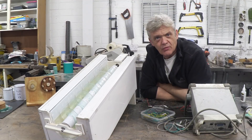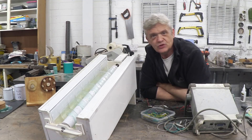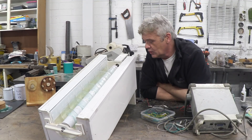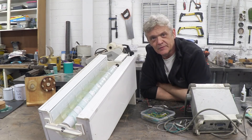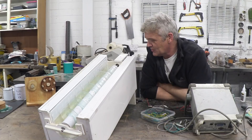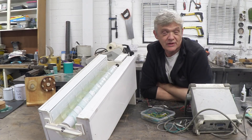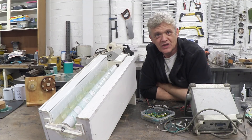Turbine screws — they are already using them in places where they're doing exactly that, with large things and a big fall of water generating kilowatts of energy. This is a scavenger, so it's meant to run small loads. Any generating device is going to perform better if you put a generator on it that's actually matched to the device — I've strapped on a NEMA motor because that's what I've got and I want to see it do something. Anyway, let's take it outside and give it a supply of water.